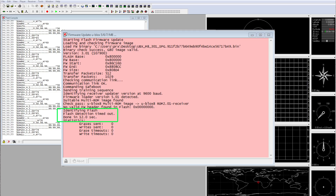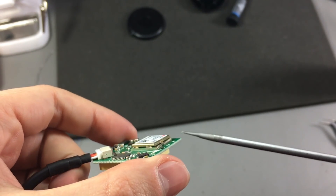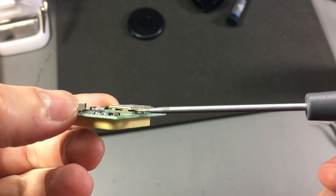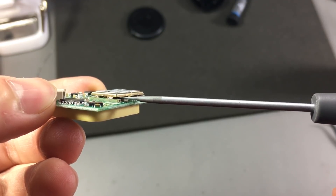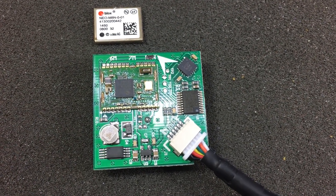That error means my module does not have a flash chip. I also wanted to get a physical confirmation, so I slowly pried the top of the can with a small screwdriver while applying the soldering iron to the joints holding it together. I managed to pull the cap off without damaging anything, and I had my confirmation that the module I have is indeed missing the flash chip.